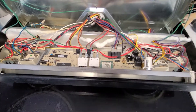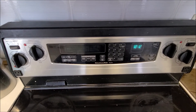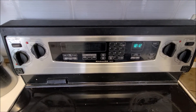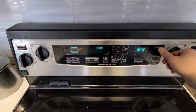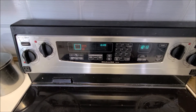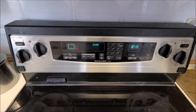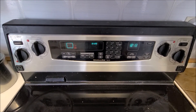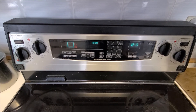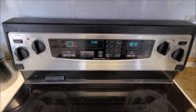The power is back on and it looks like the display is working again — there's no flickering and the lights are nice and bright. So in this case it looks like it was a bad capacitor and some loose solder joints. We were able to repair this board without having to replace it, so hopefully this video is helpful for someone else out there that has a similar issue.